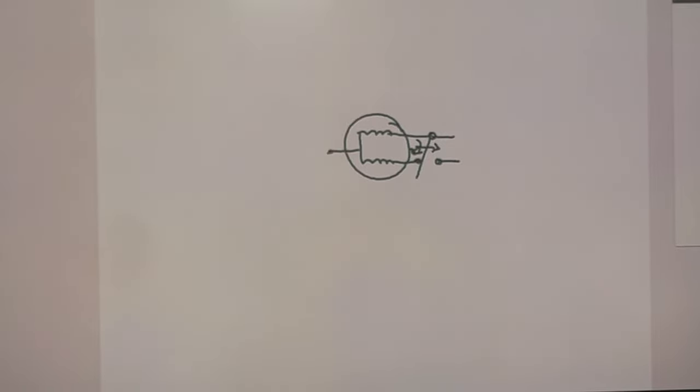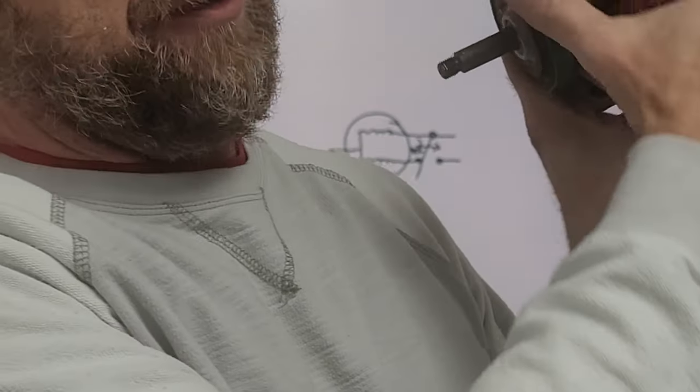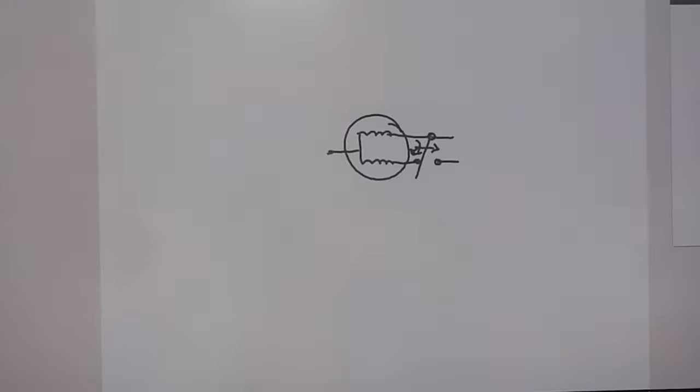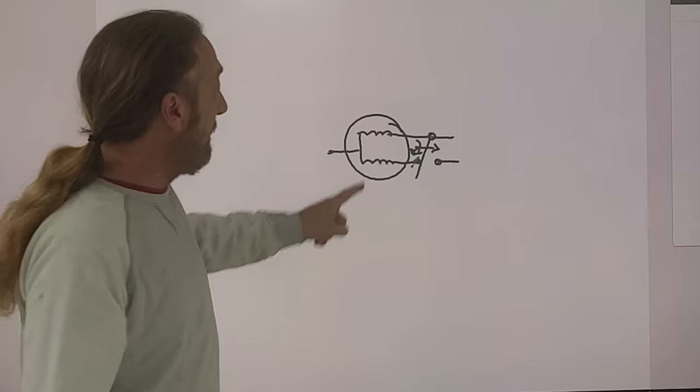This one here is a little different but still has a centrifugal switch — it's an older style with the same shifting mechanism for the switch. The black collar right here — push it in. If you look up, you can see a little white piece of plastic resting on top of it. When you slide it, you see it dropping down — that's the switch going up and down, just like turning a light switch on and off. When the machine is off, that's the off position.